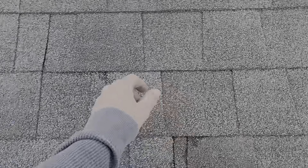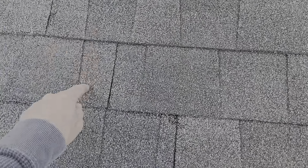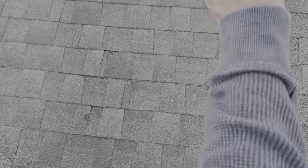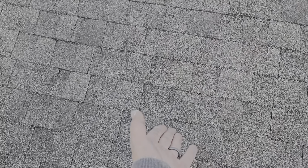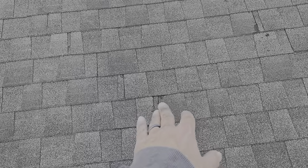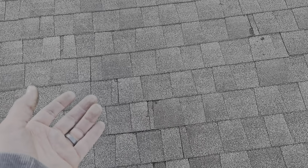Then we're going to need some shingles. Looking about four feet down, that's roughly ten rows. Ten rows times two courses — that's at least a bundle right there, since they're probably twenty to twenty-six shingles per bundle depending on brand. You're going to need at least two bundles of shingles. I'd plan on a third bundle so you don't have to run back to the store if you're a shingle short. That'll ensure you've got enough room to come down and get this section peeled apart with a flat bar.